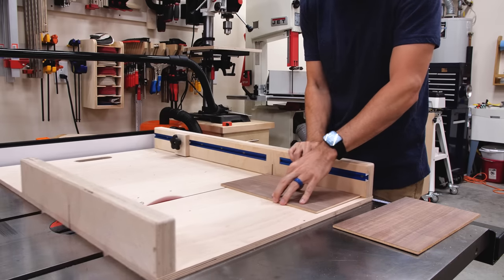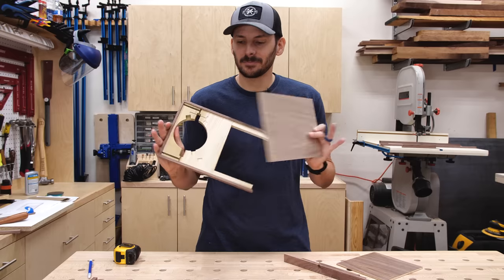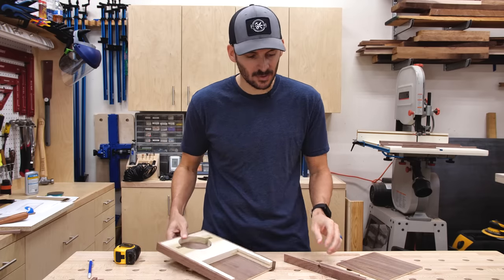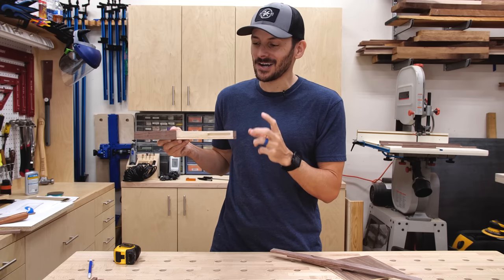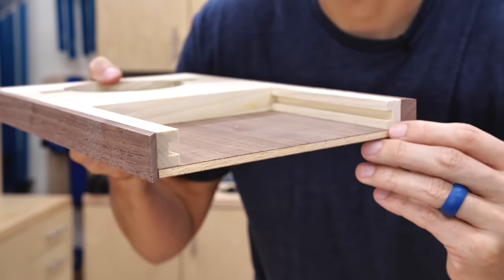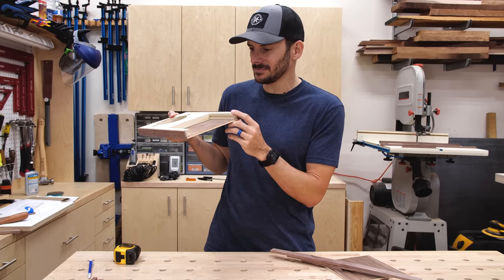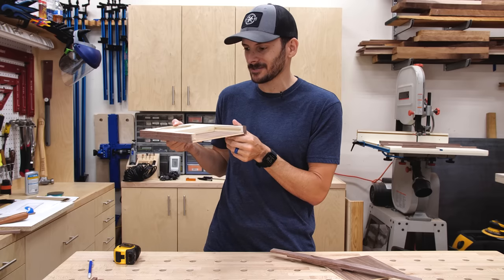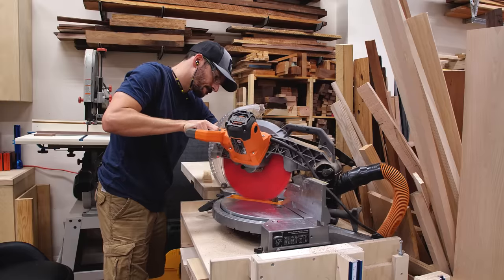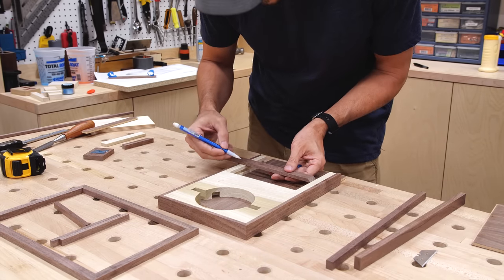This little panel is going to cover the entire bottom and conceal any evidence of the secret drawer from underneath. I got the bottom piece cut and now we can see how much room we actually have to work with for the drawer. I am a lot worried, honestly, because the room to fit the little spring mechanism for the lock is going to be like a quarter of an inch — actually even less than that. This tiny little drawer was another exercise in miter joints and I just sandwiched the bottom between the pieces and secured it with glue.